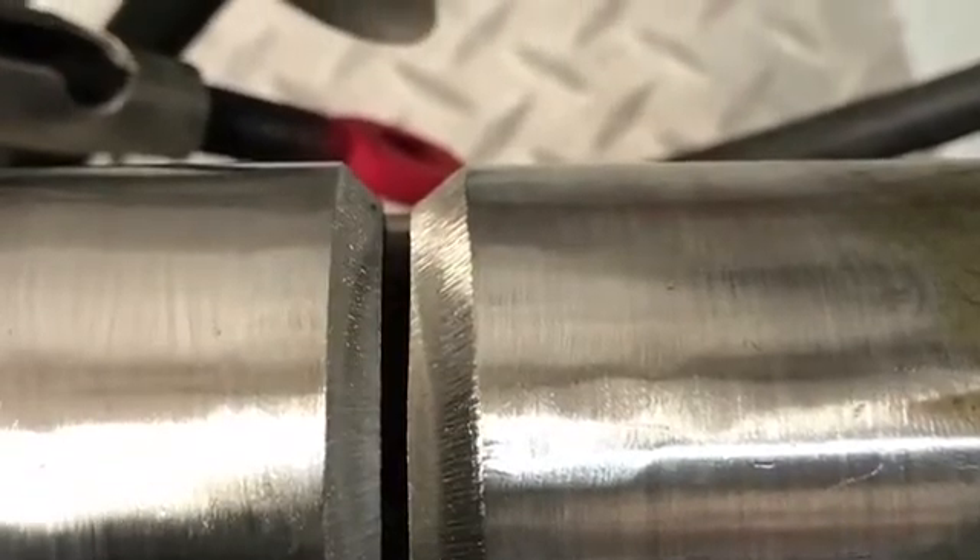Here's the fit we're going to use — it's a tight gap, a little less than 3/32. You've got to run it about 90 to 100 amps. I'm pushing the wire a little bit from the face. A lot of people might want to put a little land on it — you'll have to play with it to see — but it's a dead puddle.